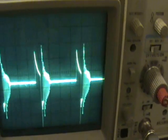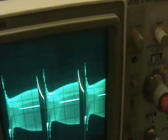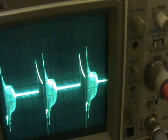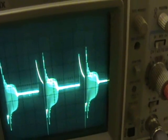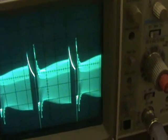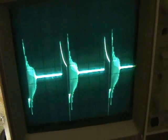You can exploit it as a function of frequency — here's me manipulating the frequency now. If I go a little bit too far to the right, I can't benefit from the ringing. Bring the frequency in a little bit, and I can exploit the ringing. So now we have that phenomenon where my hand, when it's getting near the circuit board, is causing an inductive ringing.